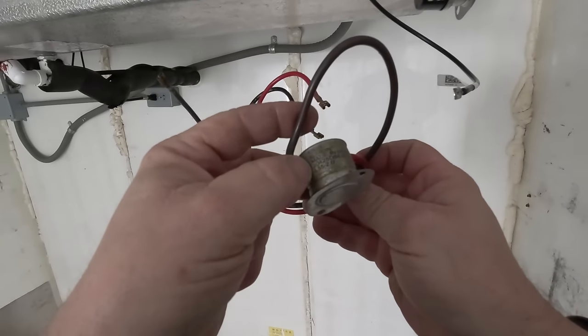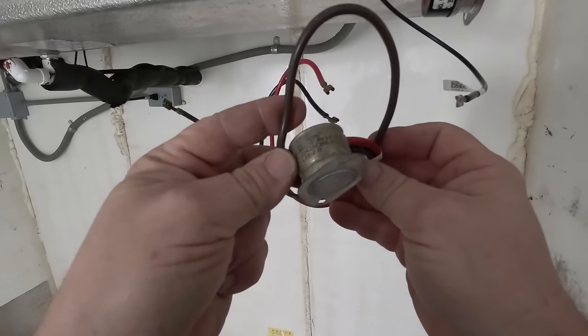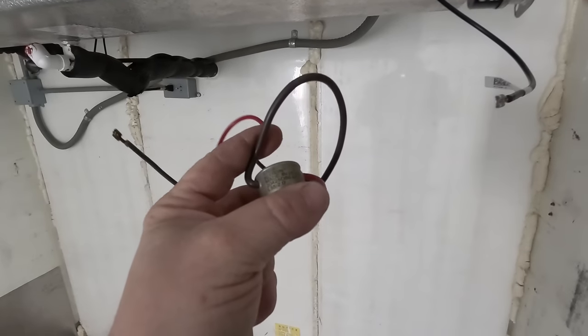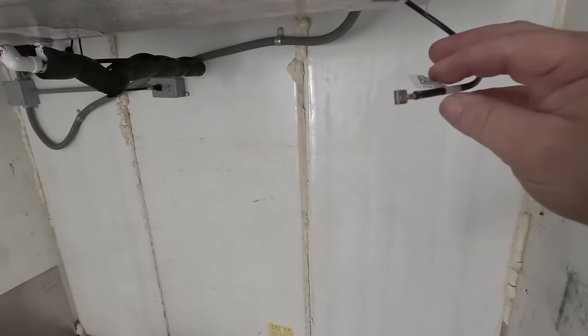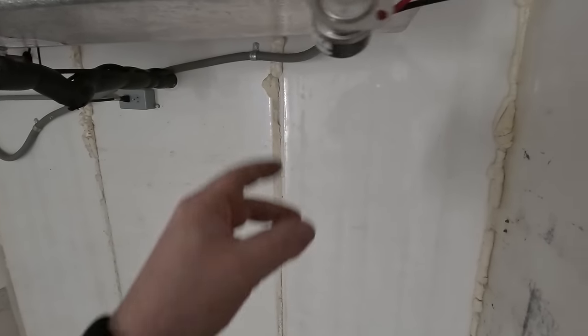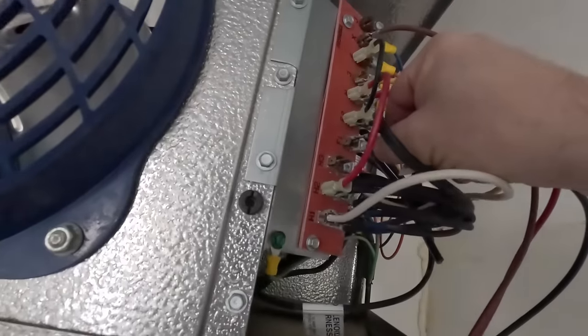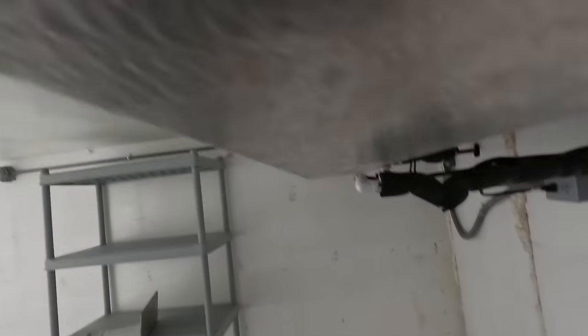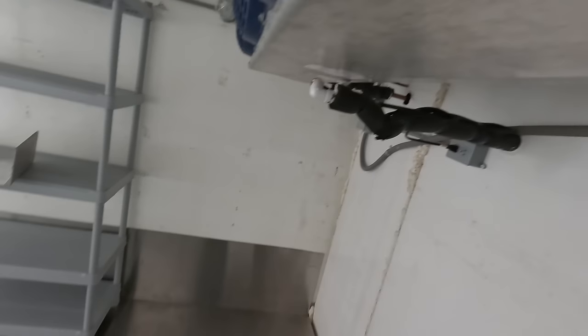This one terminates at 55 degrees. The delay is usually in the 30 to 35 range. I think it says 5709-L — this is a 5790-L. We want to hook that brown-black one on the fan — got it right there. We can put it back the way it was. I think we're going to go ahead and just put it right back the way it was — factory should already have it figured out. We'll try it and see how it does.